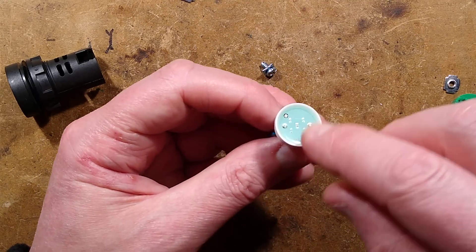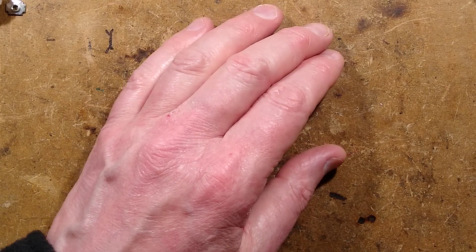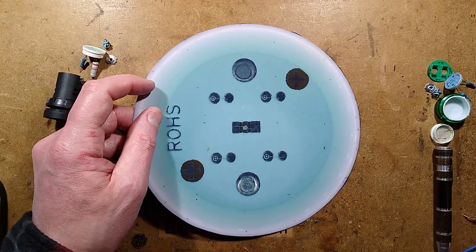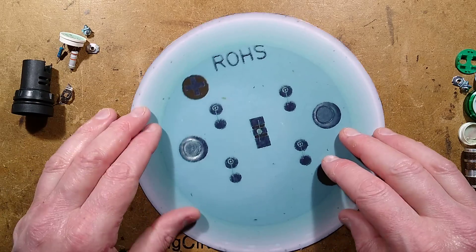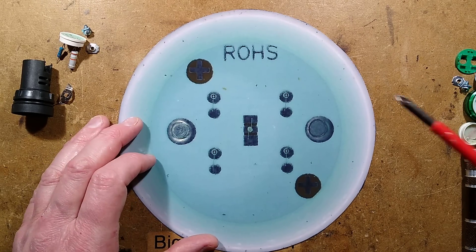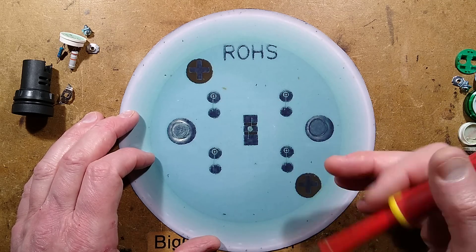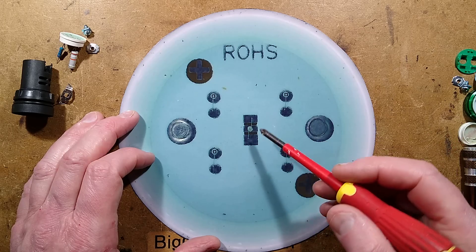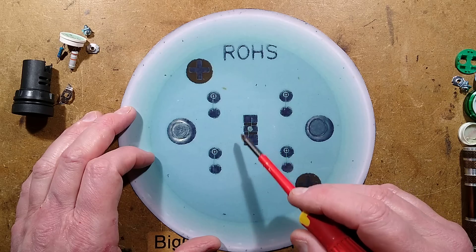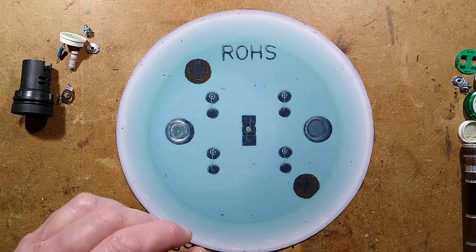It's odd that they've used two different value resistors. The other ones I looked at in the past did not use two resistors — they used a single resistor and a capacitor, which kind of made more sense. Let's take a look inside and I'll draw you a quick schematic of what's in here. There is an LED in the middle — just a single chip, which is disappointing. The previous one had a bridge rectifier made of LEDs too, about five or six LEDs, a nice simple design. This is pushing one LED fairly hard, and it's pushing the resistors hard.